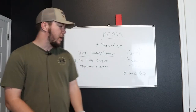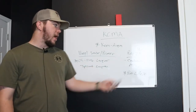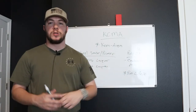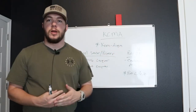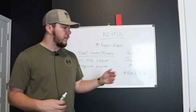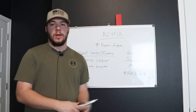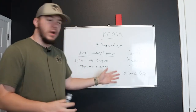You're good to go. I like to spray everything. These coatings do not roll or brush well — you cannot roll or brush a lacquer and poly 2K. Sometimes you can touch things up, but not really. You really need to spray everything. So this is for people who spray kitchens — I'm talking about the boxes and the doors. I like to do the doors at home in my garage where I have a spray booth set up. I mask off the kitchen — it takes about a day for me by myself to mask off the kitchen. I can put three coats in a day and mask the whole kitchen off, come in the next day, tear everything down, and then you have your kitchen back until I get the doors back in. I clean up the second day and I'm done and out of there on day two by myself in a typical kitchen.